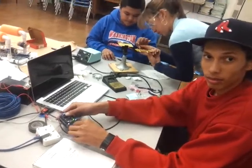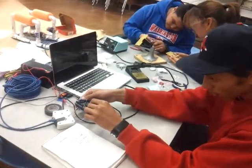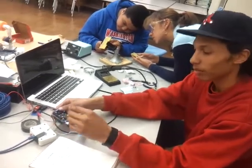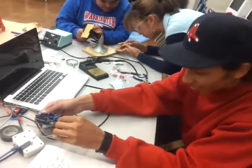That's because we're using 12-volt motors and each of them draws about an amp of current. This motor shield can only support up to 2 amps — 12 volts but only 2 amps. So running all three motors would overburden it.